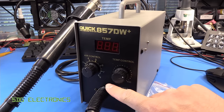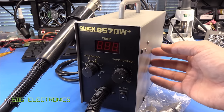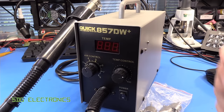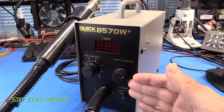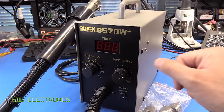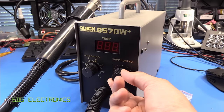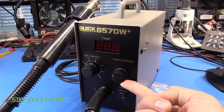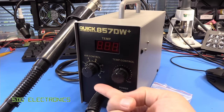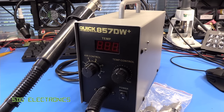Output temperature ranges from 100 to 450 degrees centigrade. Inside the blower is a brushless DC motor, as opposed to the diaphragm pump seen in the Metcal unit. What I really like about this unit is the simple user interface — you've got simple control all the way from 100 up to 450 very quickly, and the same with airflow, without having to fiddle with lots of buttons.